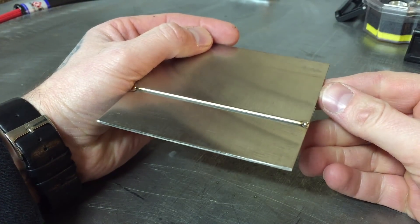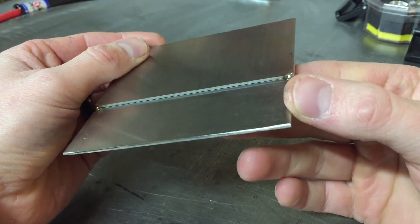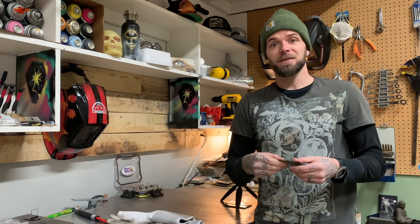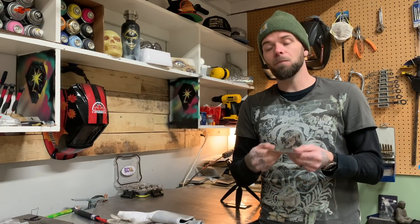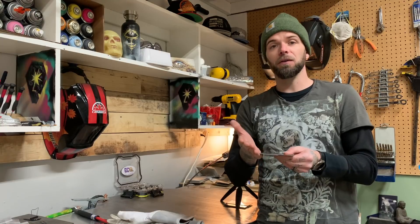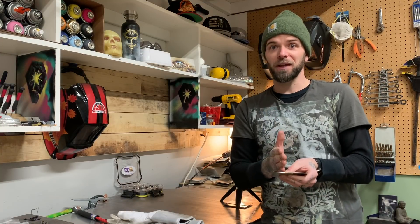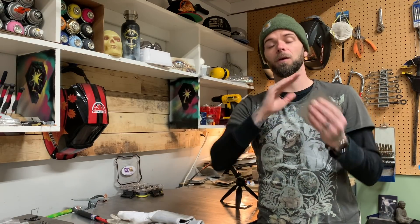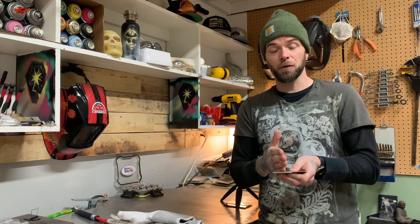This joint here is called the lap weld. Basically what it is: we have two surfaces of metal overlapping one another and creating a joint that is as tall as the thickness of the material. The reason this one's one of my favorite ones to teach people first is simply because you can't burn through — well, it happens, but it's a lot more difficult compared to a butt weld, fillet weld, corner weld, or anything like that. I usually encourage people to get a hold of this one first, and then when you move on to butt welds, fillets, and corner welds, you'll have a confidence factor built up because you can understand how to keep a puddle under control.